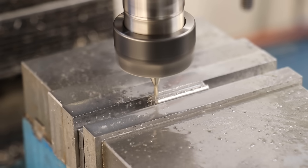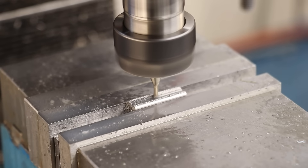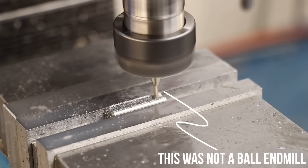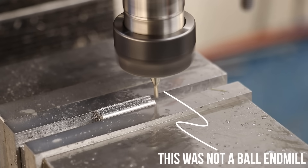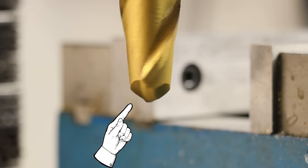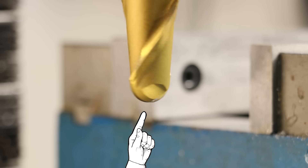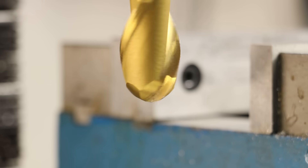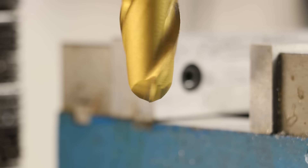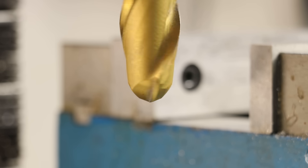Unfortunately, that is very low for small cutters in pretty much anything. With the VFD, it does let you push the RPM closer to about 2000, but that is still a bit low for a 1.5mm radius ball end mill, especially in aluminium. It also doesn't help that with ball end mills, as you get closer to the centre of the cutting edge, the rotational speed drops to pretty much zero. So whilst the outside may be running at a usable RPM, the closer we get to the centre it'll be way too slow, and that usually leads to higher tool pressure.